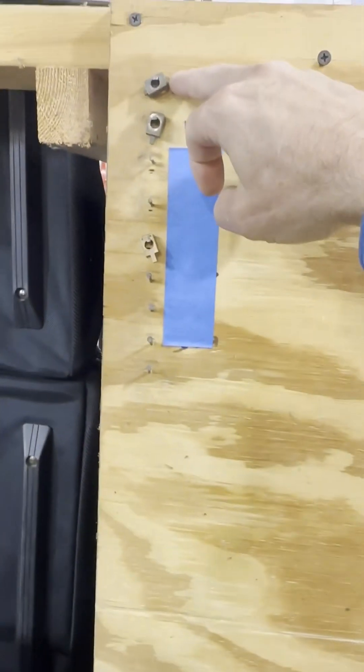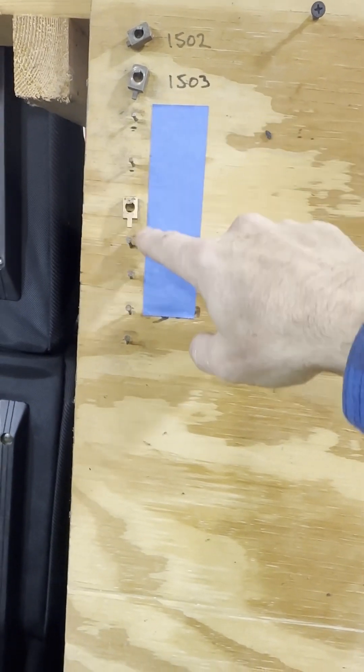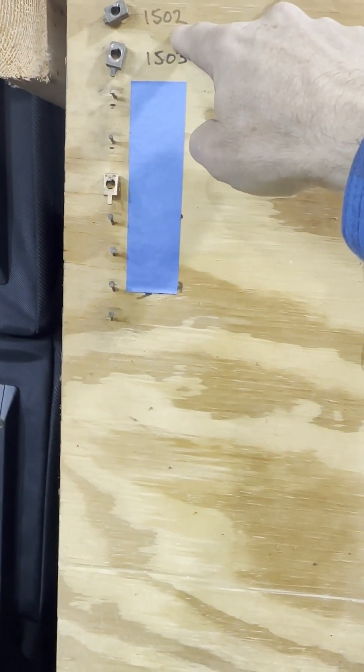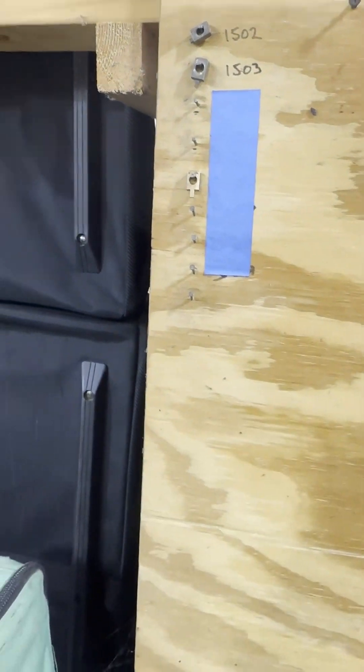We run a lot of diamonds in rotation. These are extremely fine — our 1502, 1503. Everything else down here is graduating shapes from the 1504. 1502 is 1.5 millimeters by 0.2 millimeters. 1503 is 1.5 by 0.3, et cetera. Those are nominal dimensions, manufacturing specs, and there are variants in there.